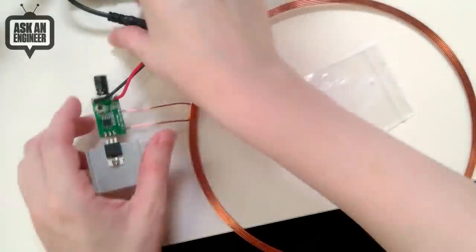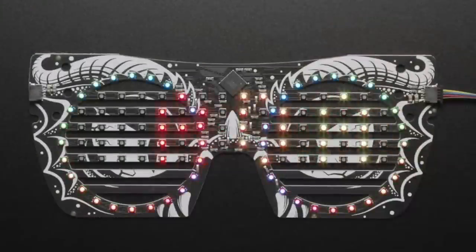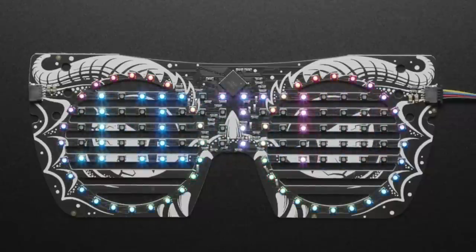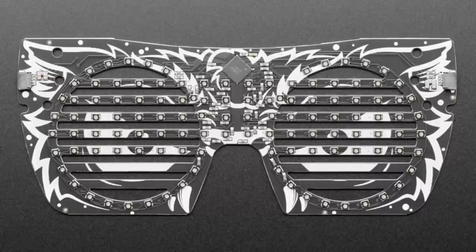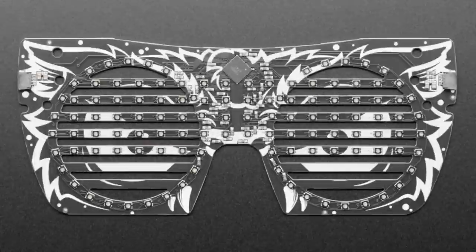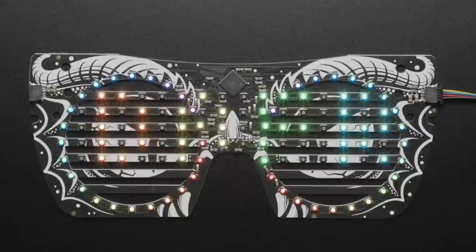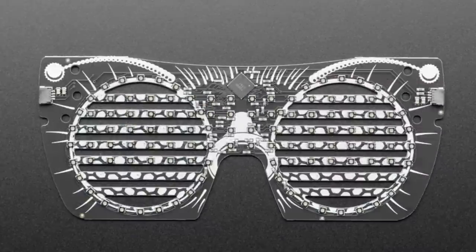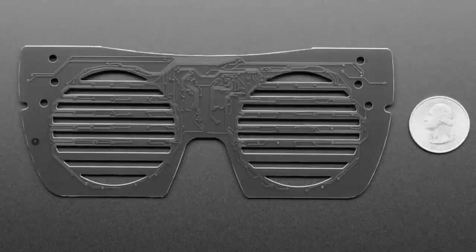The star of the show tonight is the LED Glasses panel. The product is called LED Glasses — I don't have a better name yet because that's exactly what it is. I've always wanted LEDs on your face. We've had NeoPixel projects before, but I wanted to make it really easy. Facebook and Ray-Ban are playing their games, and we're playing ours — this won't post to Instagram for you but it will look hella cool. Each board is an I2C peripheral with a STEMMA QT connector on either side and no microcontroller — there's a little driver chip in the center of the temple that controls 116 RGB LEDs.